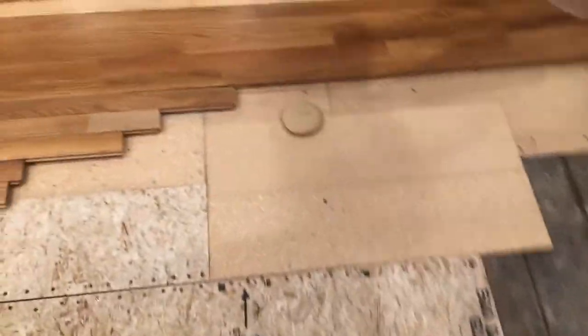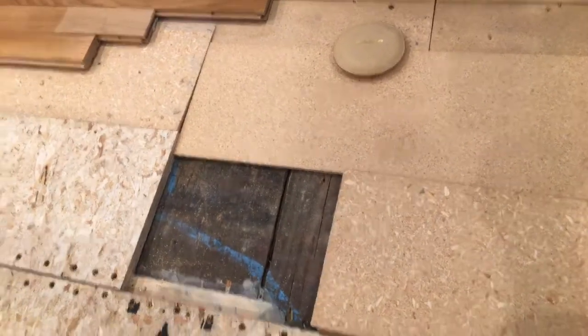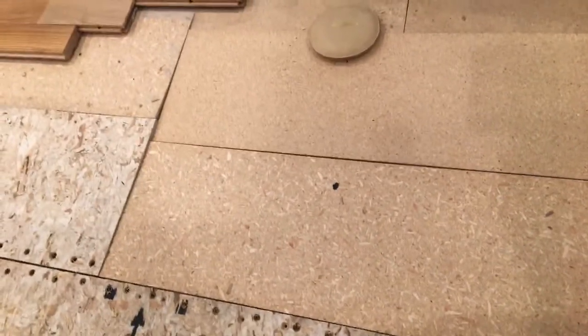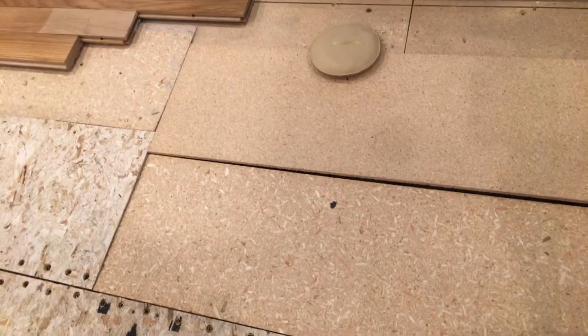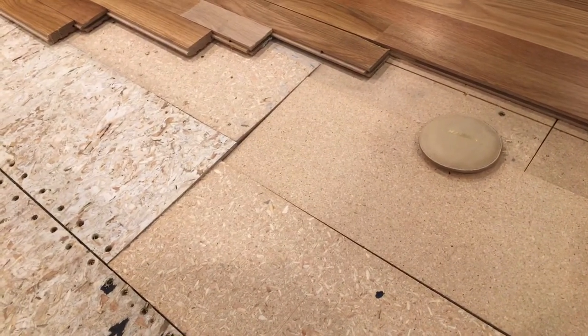Basically what I'm going to do is figure out what thicknesses allow me to transition from the OSB flooring once it gets too thin, in order to feather it out to the area I need. This isn't done final, but it gives you an idea. I need another piece under here to get it more level. You can use shims and glue — you just want to make sure you have nice solid underlayment. I've got a little high point here that I'll probably have to sand down.